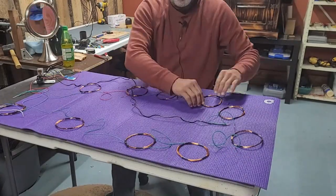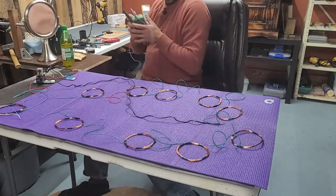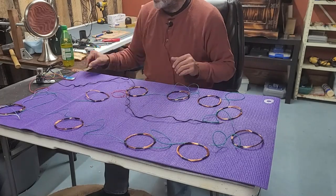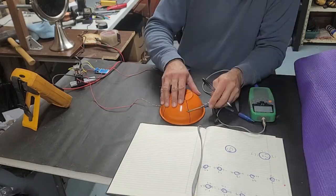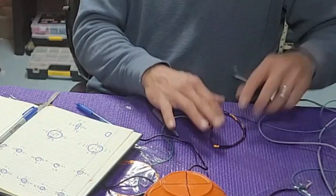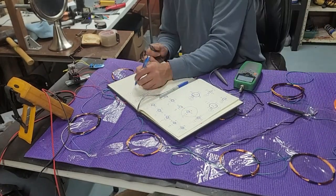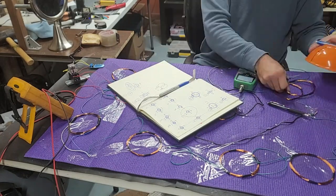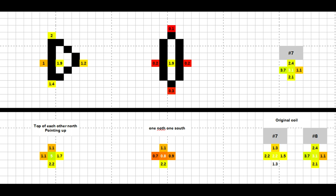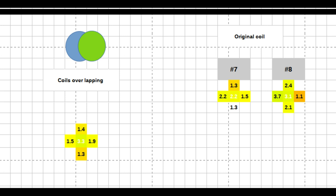All the pre-tests I did with the small coil turned out to be good. I went out testing the gauss output of every coil, increased the duty cycle, and noticed the coils were bending quite a bit. Interestingly, bending did not reduce the gauss output, but the radius got smaller. That gave me the idea to create a bubble with a dome and make funny shapes — a D-shape, a football shape. I documented everything in a cheap Excel spreadsheet. The double coil overlapping works as long as both north poles are together; they add to each other. But the D-shape and football shape lost their radius quite rapidly.